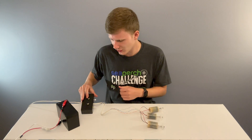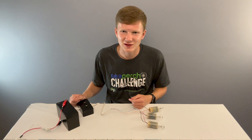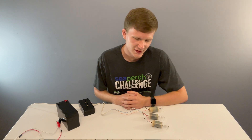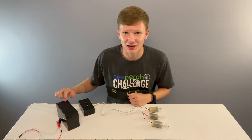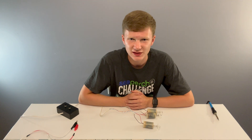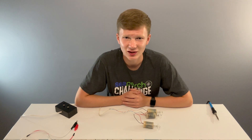You can decide which push button switch makes your ROV go up and down, but that also depends on which way you face your vertical thruster. Once you know everything is how you like it, solder all your connections together — don't forget to unplug your battery first. Once everything is soldered and cooled, wrap all the exposed sections in electrical tape. For these connections though, I actually prefer liquid electrical tape or hot glue, as electrical tape is hard to wrap perfectly.